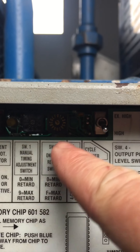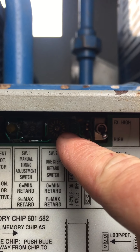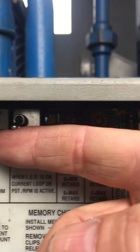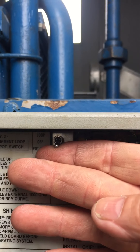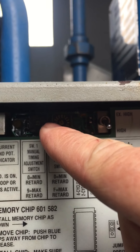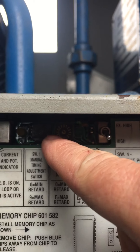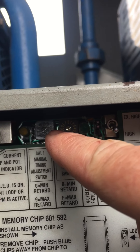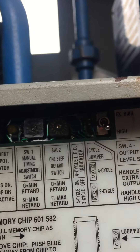You flick the switch down, the light comes on, the yellow dial set at F for max retard. Once the engine's hot, there's no reason to flick the retard switch down, so it can just stay in the off position. How to set your main timing once you've got everything done with the pickups is this white dial. You've got zero to nine on this little white dial and that'll allow you to dial in your timing to 38 degrees.